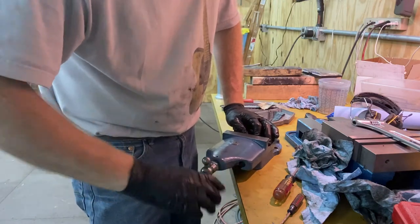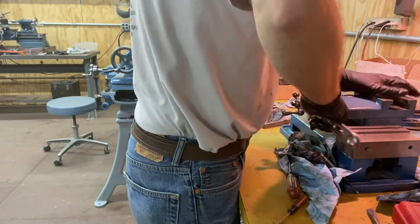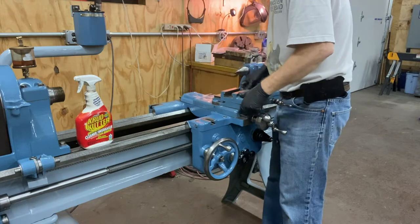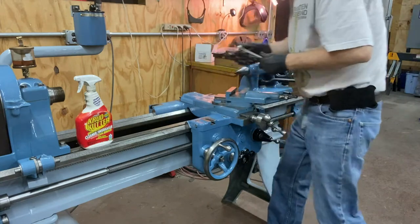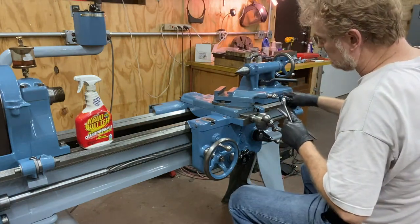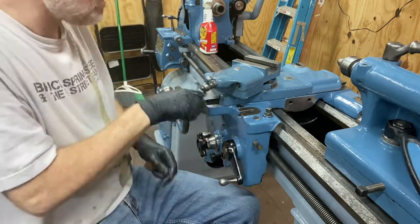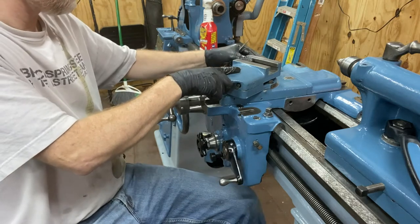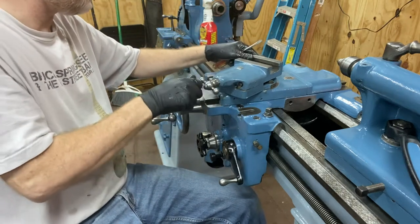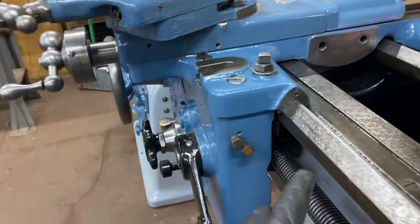Every couple of threads I advance this one, I need to back that one out a little bit. There's a little zero there so I'm guessing I need to put that so the zero is on top. Now I need to get the gib in — it's a little bit like a Chinese puzzle. We got that — it's rattling around because I didn't do any scraping on this, since it has very little motion and I doubt there's much wear on it. So like before, we slide the gib in — easier said than done. There's very little play — I think that's a perfect amount. I just need to put some oil in there and then the set screws, and that part will be done.